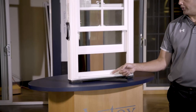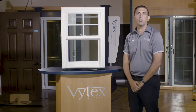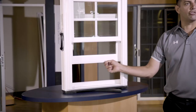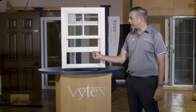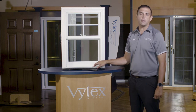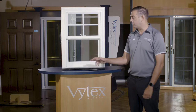A bottom sash structural interlock leg is built into the main frame, allowing the sash to straddle that leg and lock into place during heavy wind loads so the sash has nowhere to go. A Q-Lon based gasket weather stripping — the same type used in refrigerators and freezers — is a foam-based weather stripping with a vinyl covering that can change shape but returns to its original form, providing the best defense against drafts. The Georgetown window is one of the most energy efficient windows at keeping air from forcing its way in, and this is one of the key components to that.